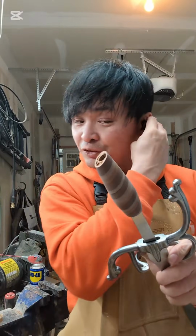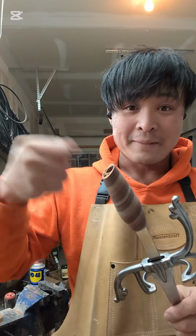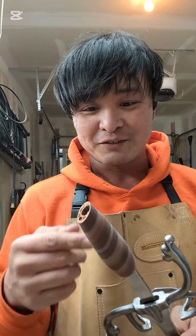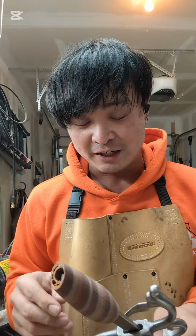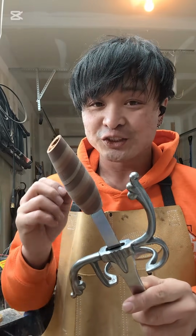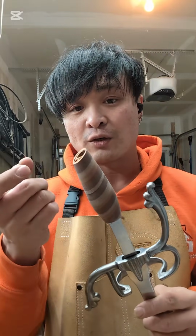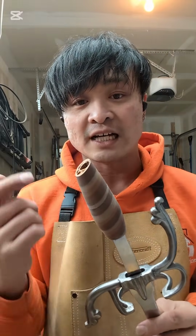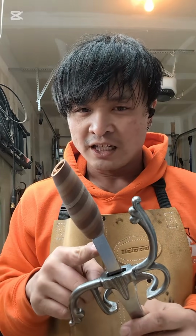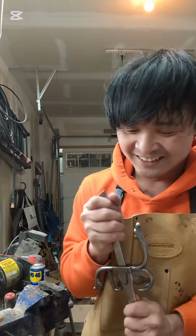So close. So, usually during this time, people would try to bang the crap off it until it goes in, but oftentimes you actually break your pommel. It's not a good idea. So when you see that, don't rush, keep filing. You could actually heat up your tang so then you actually get a really good pressure fit into it and melt the material inside. I don't really like to heat up my tang because I don't know what it's going to do to the metal. So keep filing on.